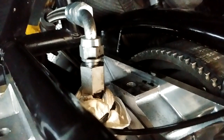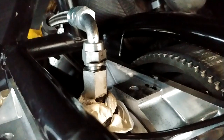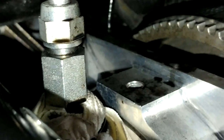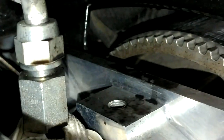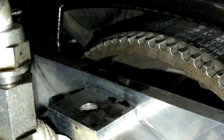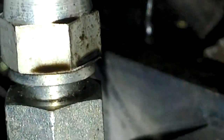All right, so before we move on to the next flight, something that's been showing up recently was a minor oil leak in this feed to the redrive here. I'm pretty sure it was coming from how the feed goes in there, one of the O-rings. But what's interesting is if you look there in the center of the screen, where I'm zooming in, there's a puddle of oil sitting on that ridge. I'm like, how did that get there? And there's also oil on the bottom of this cap here and oil on the bottom of that little nut there.